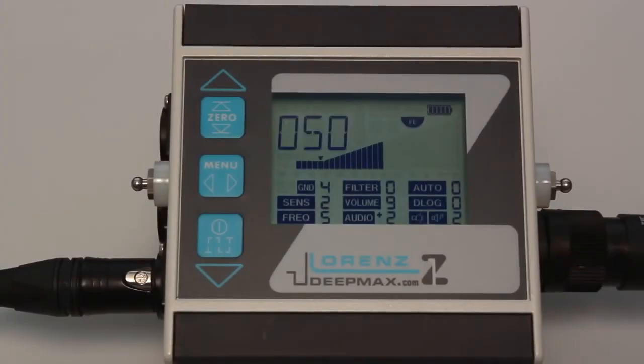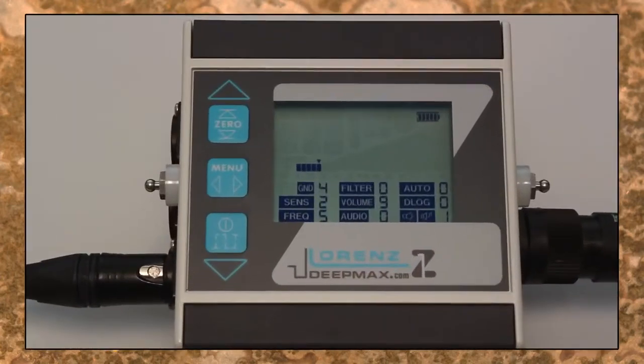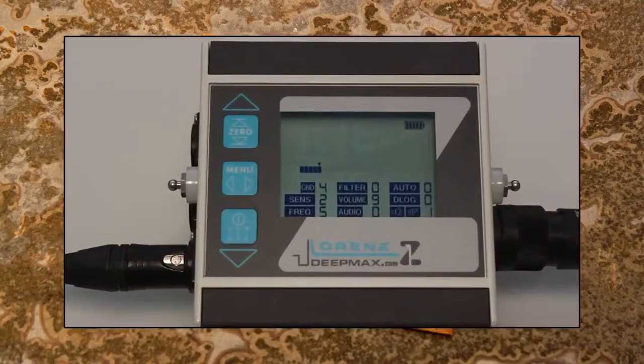Ferrous metal objects with a range of 30 to 60 are typical. In some cases however large ferrous metal objects will give a non-ferrous indication but can still easily be identified as being ferrous because of the number derived from the eddy currents. Metal objects with a very long duration of the eddy currents, for example larger copper, silver or brass plates, will lead to a very high time delay reading and a non-ferrous indication.